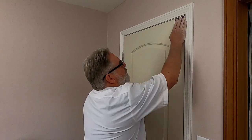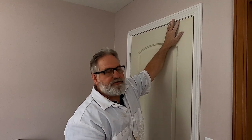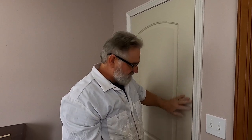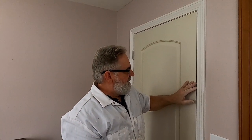I lightly sanded this door. When you have a new door and new woodwork that's pre-primed, after you do your spackling and it dries, you need to lightly sand it with 220, and then lightly sand the door. You want to make sure you get all the oils off from handling it. Then we're going to wipe it down with a really damp cloth just to get the sanding dust off. If you wait to paint the door for weeks or months, you're probably going to have to take a little more time cleaning it and sanding it before you paint.